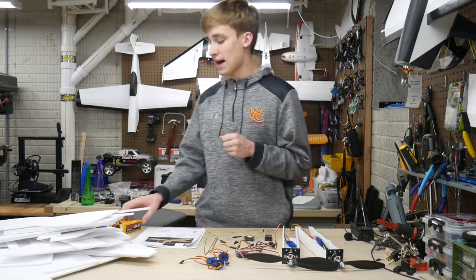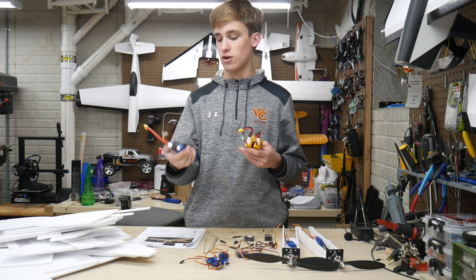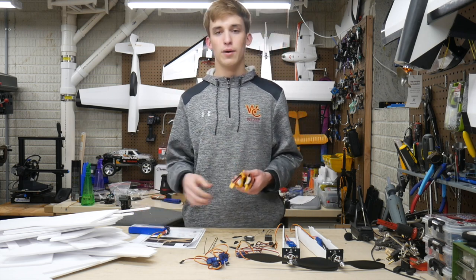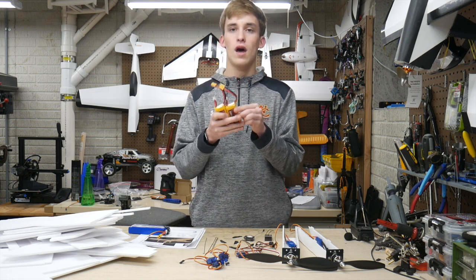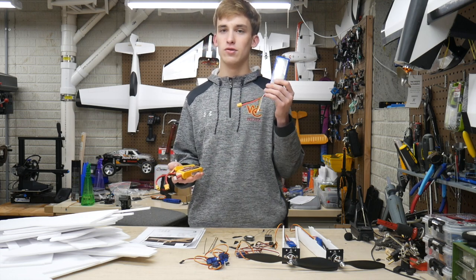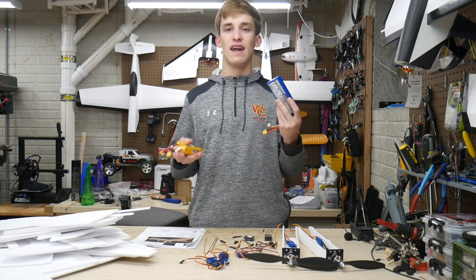Let's talk about my battery setup. I'm going to be running two different configurations. I'm going to run the 5,000 mAh 3-cell right here — this is a Turnigy, it's an RC car battery, very heavy but that's kind of what you expect. This will be good as a standalone single battery, but also if I have some extra 2,200 mAh batteries I can run those two in parallel to make a 3S 4,400 mAh battery. That's probably going to be about the same flight performance. I like to use the 5,000 mAh one as an RC car battery and as a goggle battery, so I'm going to try to set it up so I have that option to run both.